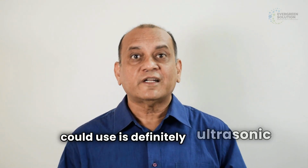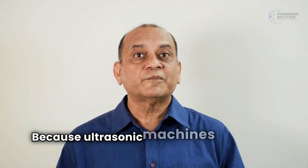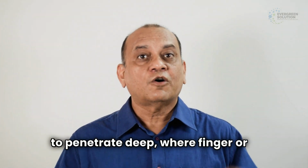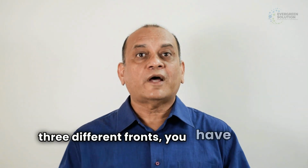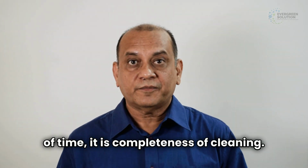One other leverage that you could use is temperature. As you increase the temperature, the cleaning time comes down. And the third leverage that you could use is definitely ultrasonic machines, because ultrasonic machines give you the ability to penetrate deep where a finger or a brush or a wire cannot reach. So when you attack this problem from 3 different fronts, you have a massive reduction in the total amount of cleaning time. Also remember, it is not just reduction of time, it is completeness of cleaning.